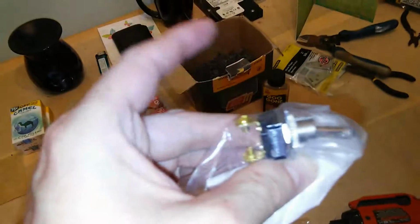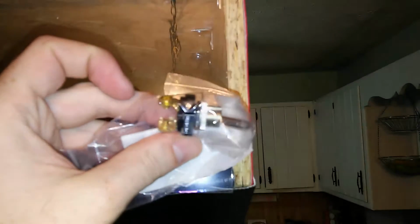So these look like they're about half an inch thick, which means they won't perfectly fit as far as the width of a piece of OSB here at 7/16 of an inch, plus about 1/16 of an inch for the vinyl on the outside. So I may actually have to recess the interior of the OSB to get this thing to mount properly.